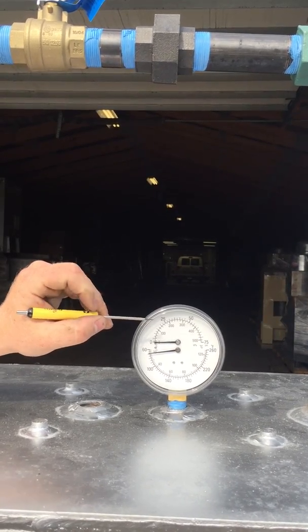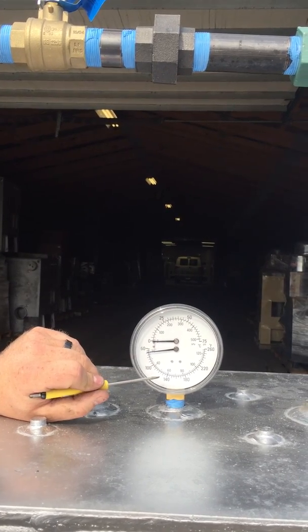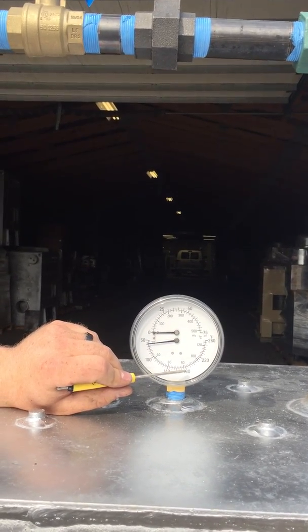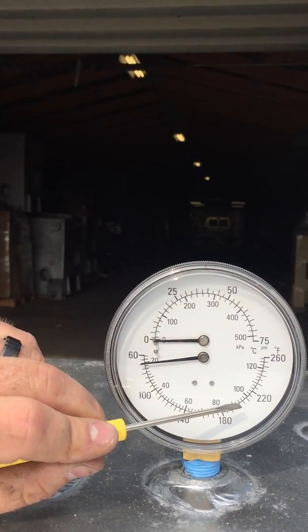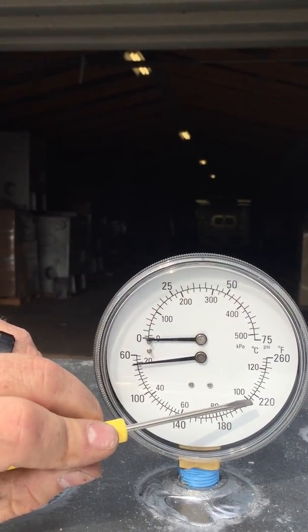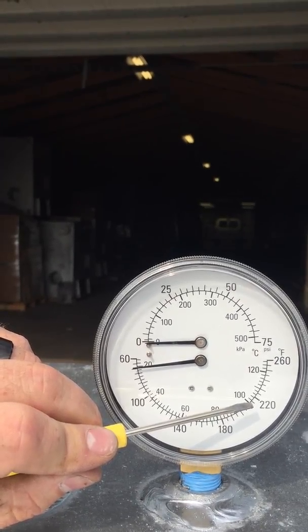As far as the temperature of the boiler, your operating range is between 140 and 180. On these furnaces in the summertime it may idle up to roughly around 200. We do not want anything near 220 — if anything near 220, that becomes a problem with overheating.